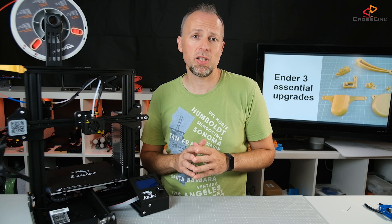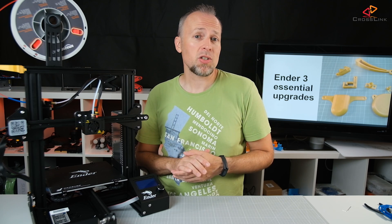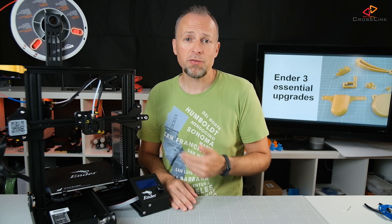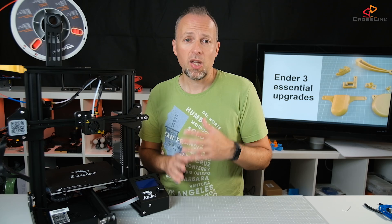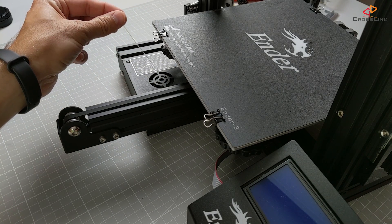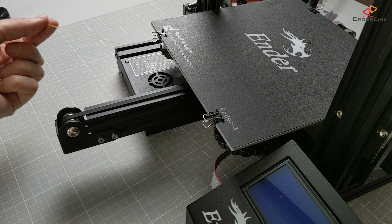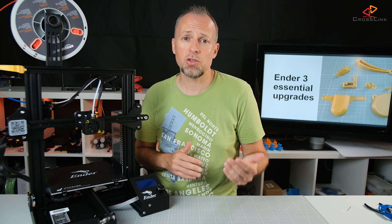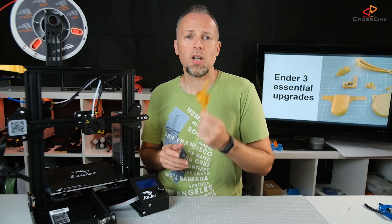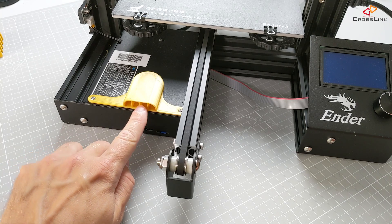The next upgrade tackles a small but potentially critical problem, especially if you use this printer for a lot of prints with overhangs and retractions where stringing can happen. When these little plastic strings fall down from the nozzle or printed part, they usually get blown to the left by the cooling duct and fall off the heat bed, mostly landing on the left-hand side of the electronics case. Some filament strings are really thin and lightweight, and if the cooling fan of the electronics case sucks them in, the fan can get stuck and cause the electronics to overheat. This could explain sudden layer shifting due to stepper drivers overheating. So let's apply a cover for the fan that reroutes the airflow to be taken in from the front of the electronics case, which is not prone to filament strings falling down to it.